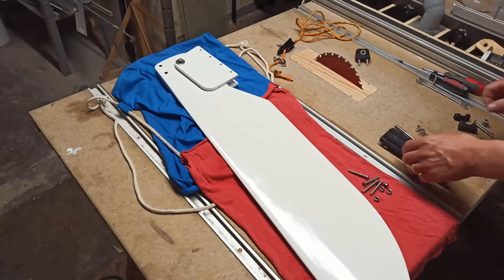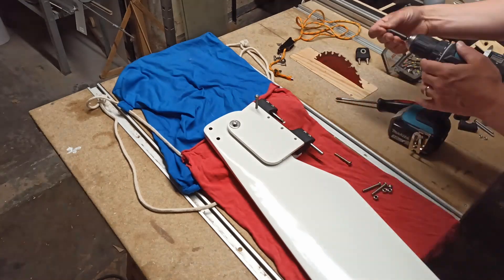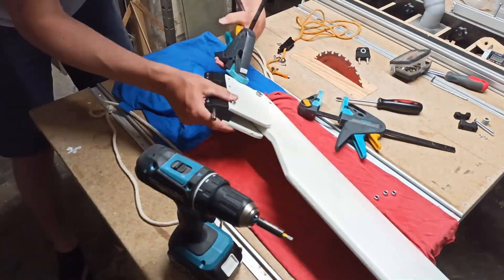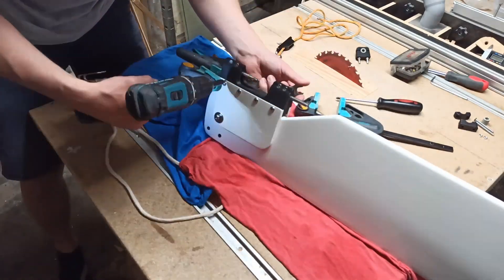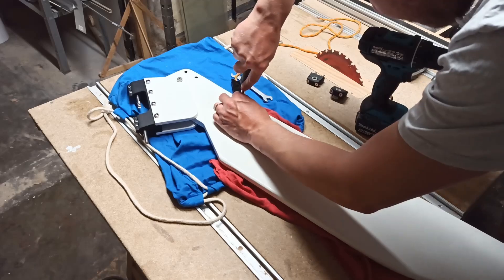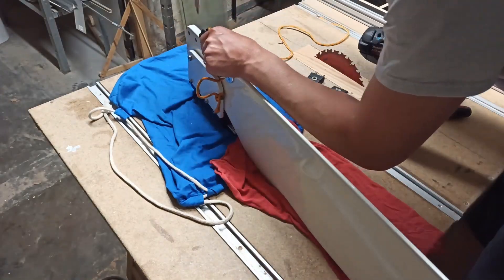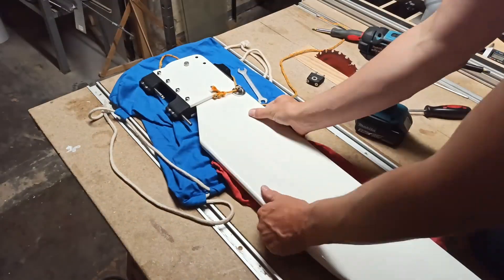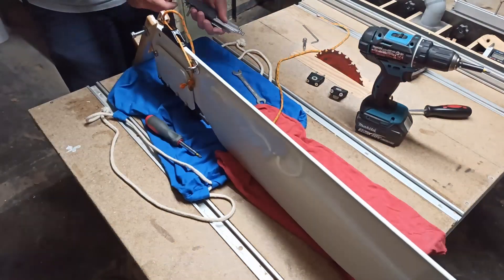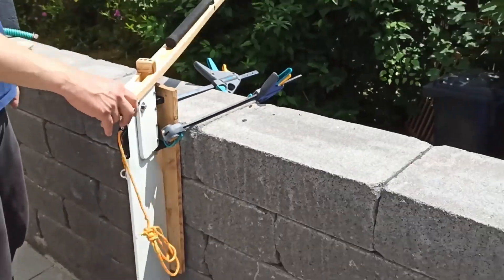When all the parts were ready, I started assembling them. I also needed some stainless steel screws, nuts, and washers. For the rudder hinges, I used M8 sliding bearings, which fit exactly into the 3D printed bearing holders. The rudder blade locking mechanism consists of a rope that is attached to one of the side plates, deflected once, and then passed through a clam cleat. I also installed a rotatable plate in the upper bearing pin to prevent the rudder from slipping out vertically.